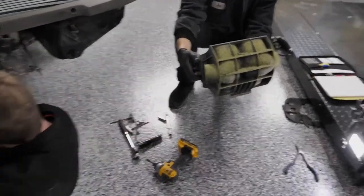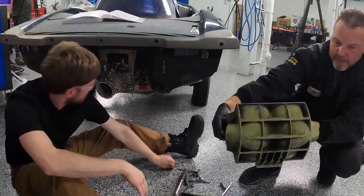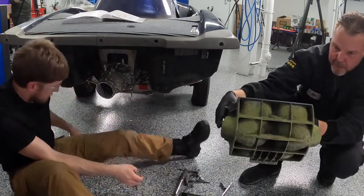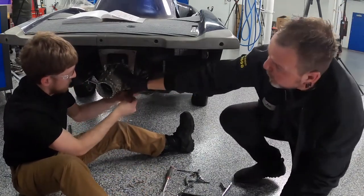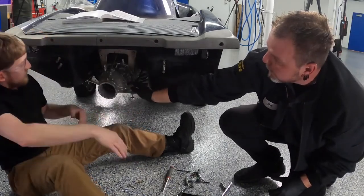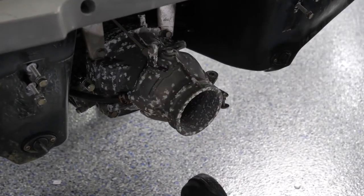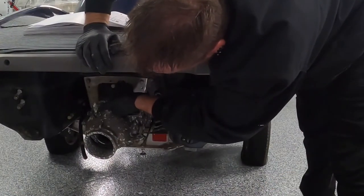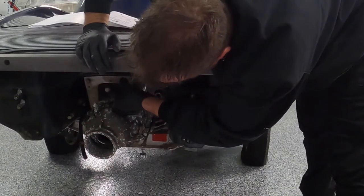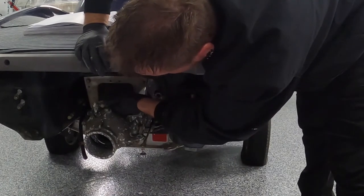Now that the reverse bucket is removed, this is what's in front of that nozzle. A lot of times this is all you really get to see when you're looking at the back of a jet ski. You also get a great chance to see the actual nozzle itself and how water is directed to steer. Your pivot ball right here should be cleaned and lubricated as normal maintenance — and since that's underwater, that would be marine grease. We only want to use marine grease on this.